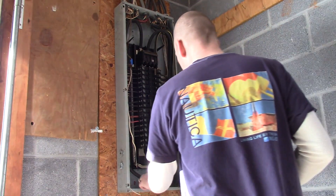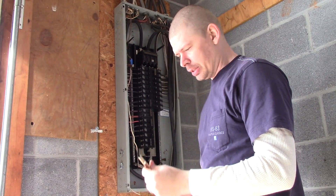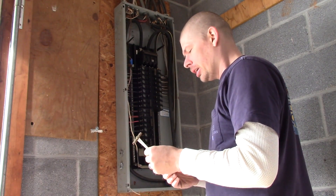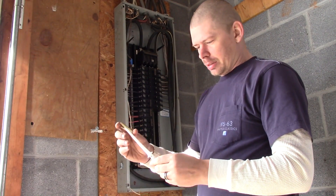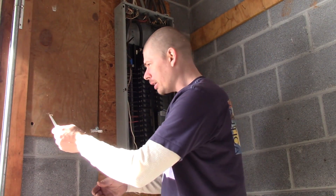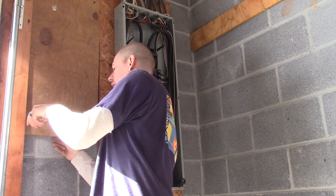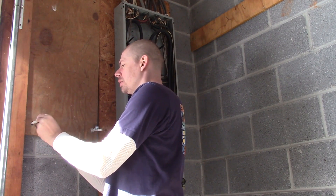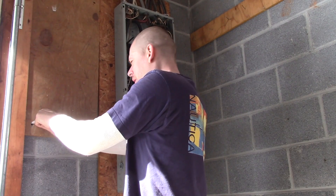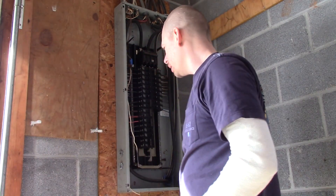I'm putting this onto the wall. I've pre-drilled four holes. I've got toggle bolt connectors right here. These are actually really strong toggle bolts. They just rotate and then when they're inside the wall you can rotate them with your thumb. You take it and just insert it like so, and be nice and gentle. Once it's through the wall, you make both of those leads nice and tight and then it'll hold it. Then you take the plastic tab that's in the center and just press it all the way forward. And there is your toggle bolt.